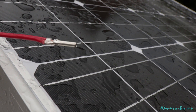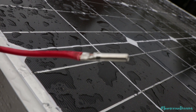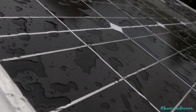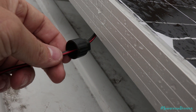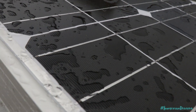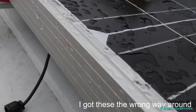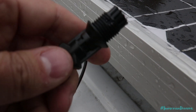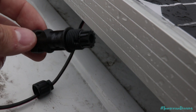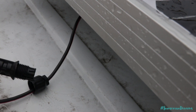I've cut the wires and added a connector onto the end of the positive cable of one panel and the negative cable of the other panel, so they're ready to go. I've slipped over the connection nut just here. Now I need to push these onto the end — this is the positive one because it's slightly narrower, and you have the negative one as well. It pushes up into this end, and when you push it in you'll hear a click. That's when you know it's joined up, and then you screw the nut onto the end and it pulls it in nice and tight.